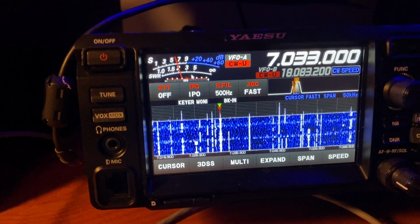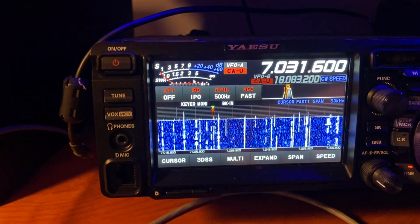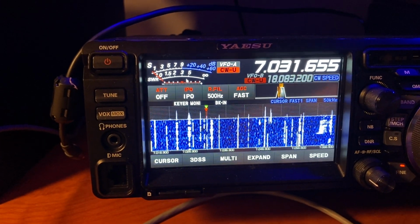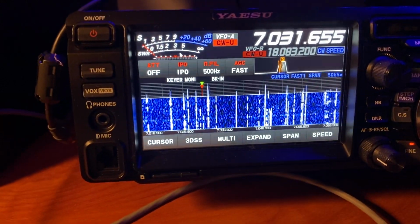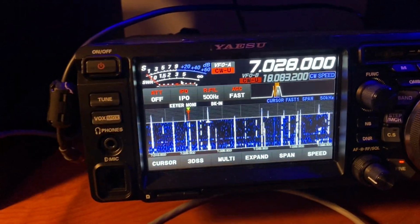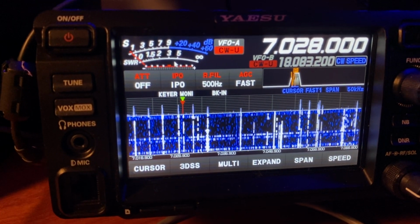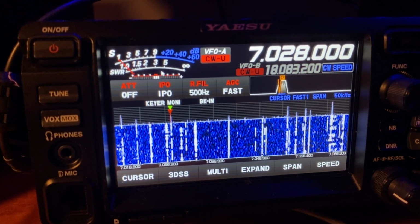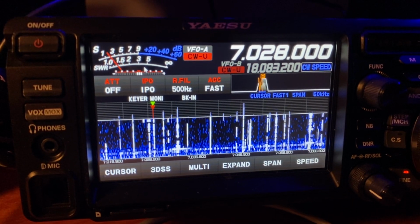That's W1AW. That's why the pile up. Let's see. If you'll notice, the loop is a tad bit noisier, not a lot. If I can get somebody to stay, switch back to the end-fed half wave. End-fed half wave. There's a loop. End-fed half wave. So you'll notice the noise in the pan adapter go away when I go to the end-fed half wave.